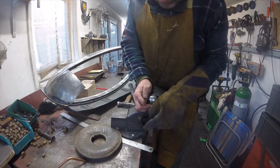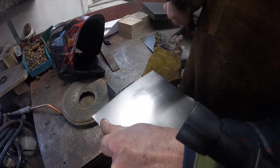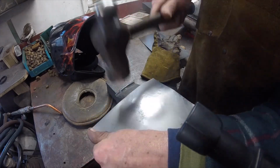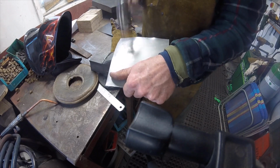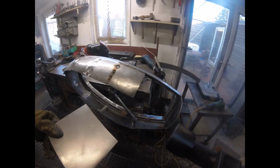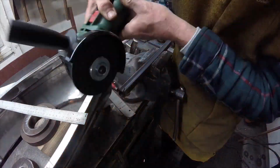But she's coming together. Like I say, ERW, the box material that you can see there, with lots and lots of holes in it. This is going to go to the chemical, in as much as it's going to be galvanised and powder coated. So when they galvanise it, they dip it, the liquids all come out. In fact, I've got some new pictures. I might be able to post another picture in a minute. Yeah, so you've got to allow all the chemicals to come out, and so you've got to leave lots of holes. You can't leave entrapment areas, because if you do, they can explode, and it's very dangerous for the people that are doing the dipping. So yeah, make it safe for them.